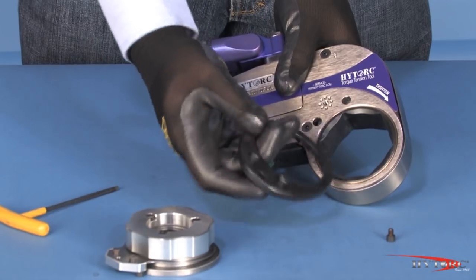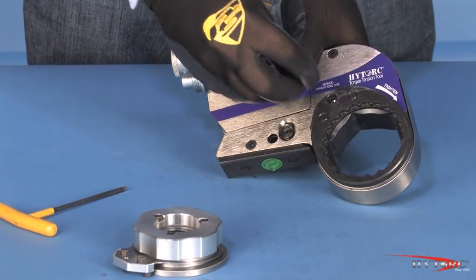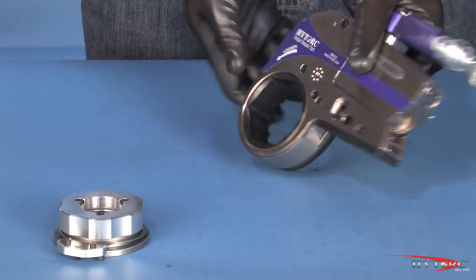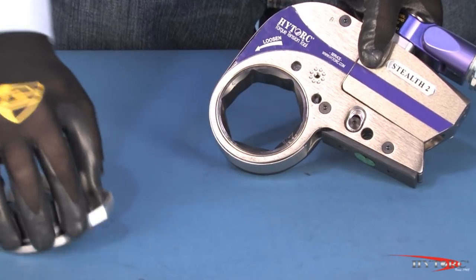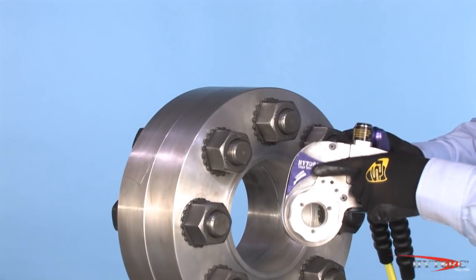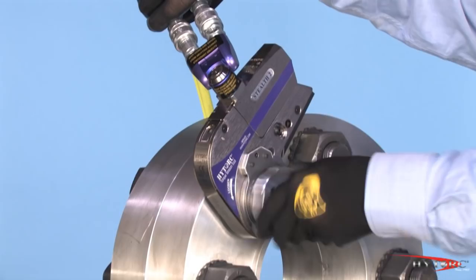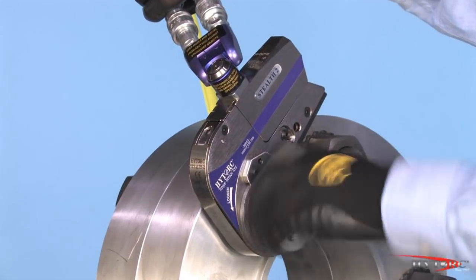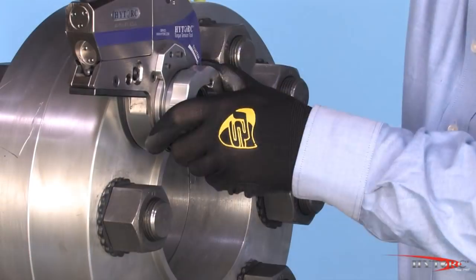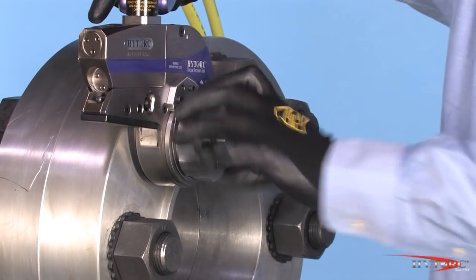Invert the tool and attach the reaction plate and secure it with a screw. Flip the tool and engage the tool holding plate. Place the tool onto the stud and the new high torque washer with the loosened side of the tool away from the joint face. Snug the retaining nut in place by hand and you're ready to go. Long stud? No problem — just run the retaining nut down until the tool is secure against the joint.